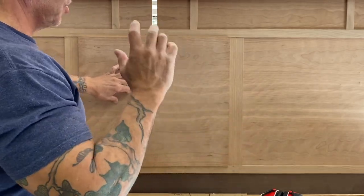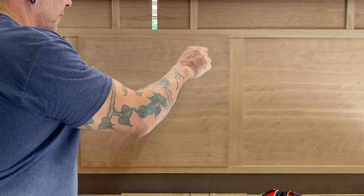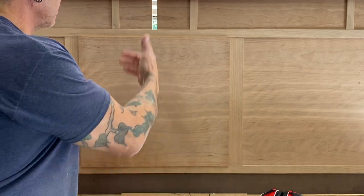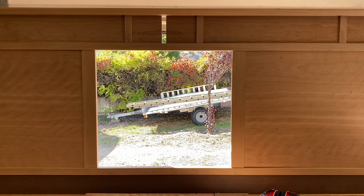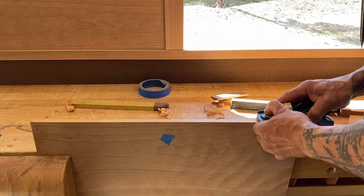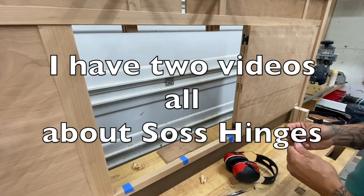I've got this just fitting about perfectly. I need to touch it up with a hand plane and maybe take a little off the top — I could probably have a small gap at the top and it won't really be visible. I opened my garage door to take advantage of the light coming in from behind, which made a huge difference — I could see exactly where any little discrepancies were and patiently fine-tuned everything till I got a really good fit.